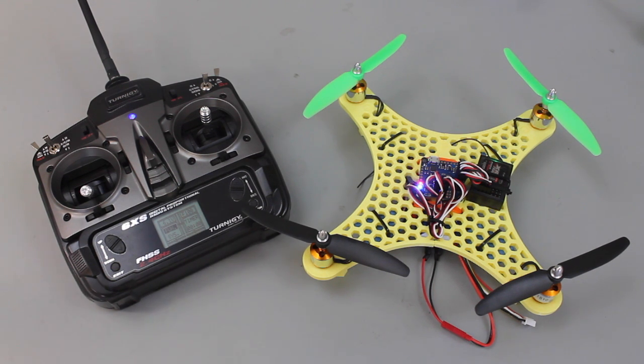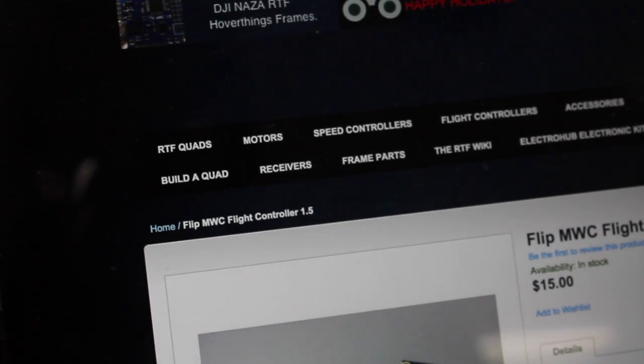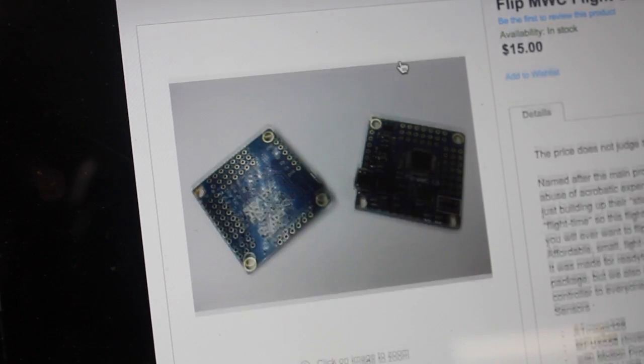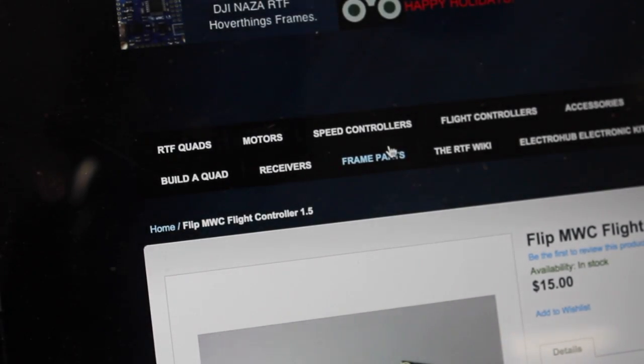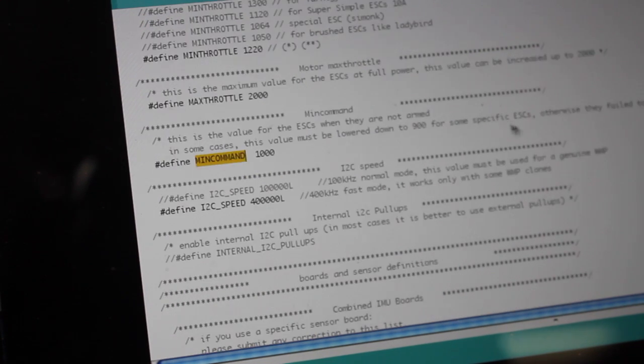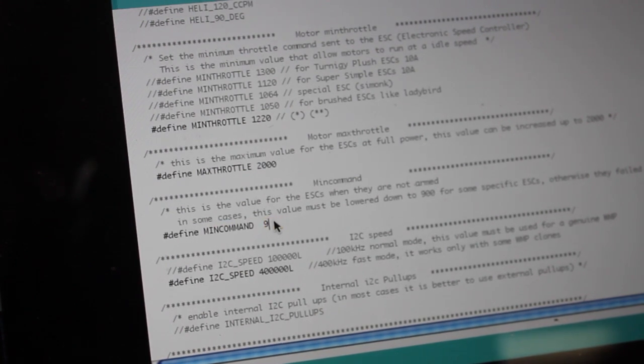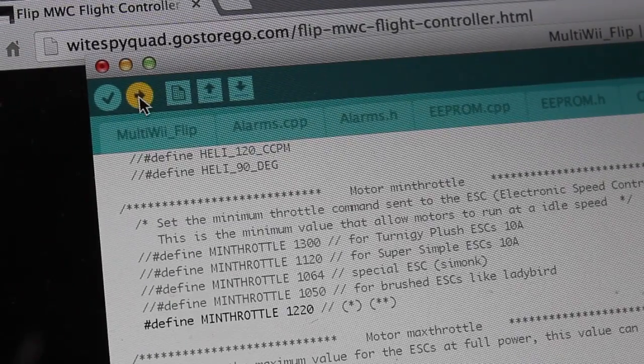Let me show you how to resolve that problem with the MultiWii firmware. We're looking at the MultiWii firmware in the Arduino IDE. This firmware you'll need to download from the Ready to Fly Quads website - there's a link to MultiWii 2.3, and I'll put a link in the description below, but make sure you grab that version. The key here is the MIN_COMMAND parameter - it says 1000. There's a comment that says in some cases this value must be lowered to 900 for some specific ESCs, otherwise they fail to initiate. So I'll go ahead and lower that to 900 and then upload it to our board.